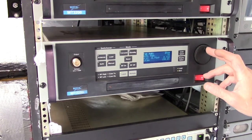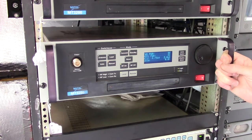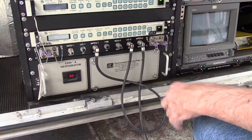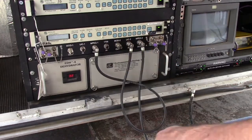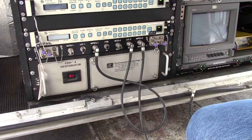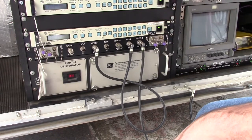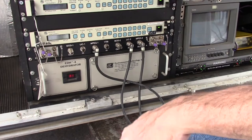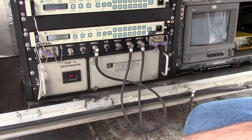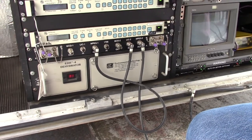Thomas, if you would be so kind, maybe show them a quick shot of the dehydrator. Environmental Technologies pretty much are the only ones I know of that make them. In the interim, the tubes are cooling off right now, which is why you still hear those running. As you know — or maybe you don't know — anytime you're done transmitting with a tube, turn the transmit off and let it cool for five minutes before you turn the power off.